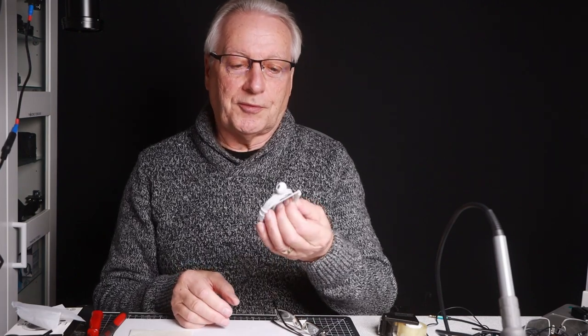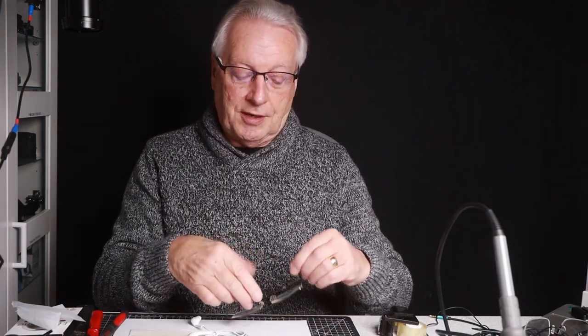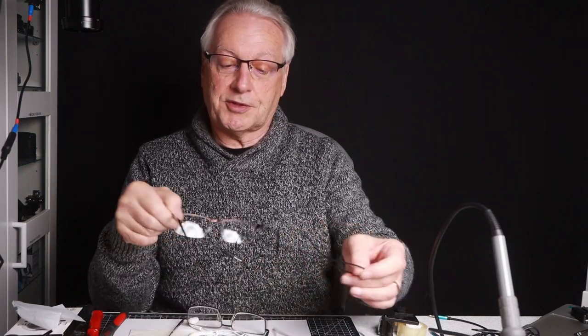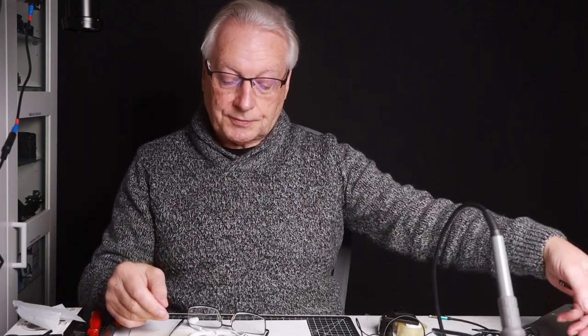To prove this works, let me attach these to the microphone. These are the spectacles we've just added the microphone element from the donor earbud set — just removing the microphone element and attaching it to the sides of the glasses. The hardest part is concealing the microphone in the glasses frame. If you've got a thinner frame you're probably better using that very small microphone capsule I showed initially, which is the one I used on my own glasses. That smaller microphone element is much better to conceal than the element with the printed circuit board.